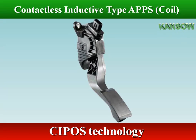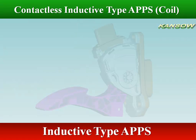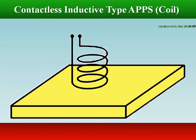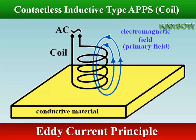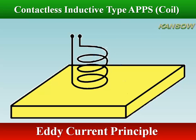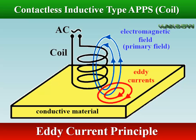One way of measuring rotational position in a contactless way is by using an inductive principle. The inductive position sensors operate on the principles of wire loop induction and eddy currents. The eddy current method is based on generating circular electrical currents, or eddy currents, in a conductive material. This is achieved by the use of a coil connected to an alternating current generator driving an alternating magnetic field, called the primary field.